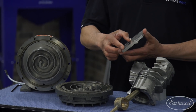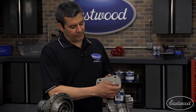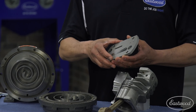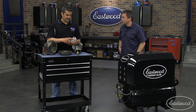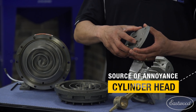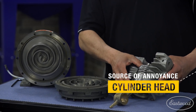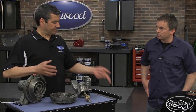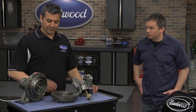This is the typical head. What's termed a reed valve in here — piston moves down, valve opens, pulls air in, and then exhausts it out. This is that noise that you hear in that compressor — the concussion of the air slapping on here. Also, with the motion of an up and down, you have that translating right into your tank, whether it's a horizontal or vertical tank, down into your floor. And that's what gives you that low frequency annoyance, especially when you're blasting.